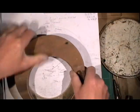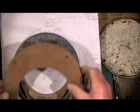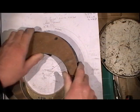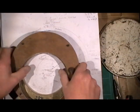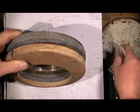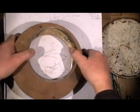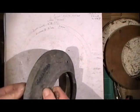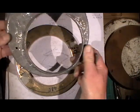I'm not showing you very well because it's not dropped onto the flange. What's happened is with me handling these lead flanges they've just moved a little bit and I can't get it on - it will go though. I don't want to force it on because I'm going to reuse this and I don't want to damage it. So imagine it's flush up to there now - with this plate on I can clamp it all up and hammer me top flange on like so. Then I take it off and that's that flange completed. It's a really good fit, so that's me backhead flange done.